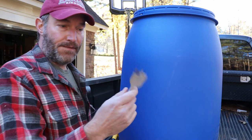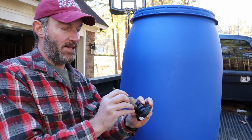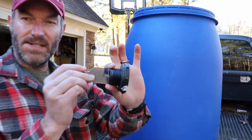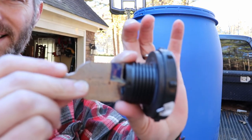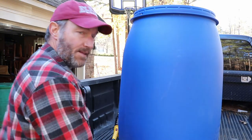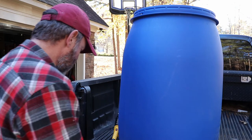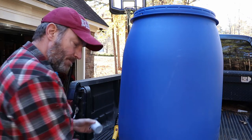What I have is an inch and a half drill bit, which is just a titch smaller than the inside of these threads. Let's zoom in — it's just a titch smaller than the threads, because I want that thing to be tight as a tick when I put it through that hole. Of course, I got some wrenches and some pipe dope.